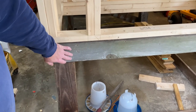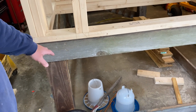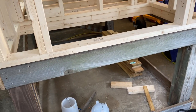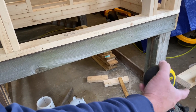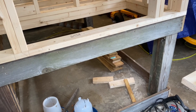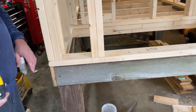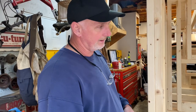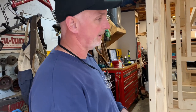We've got some five-quarter board kind of banding the top of it and banding around the bottom. We've got a couple of cross braces, and that's what we framed up for the chickens to actually have a lower run that will be covered by the roof. This whole thing will have a roof on it, and we'll have a door down here to where we can open it up and give them access to a bigger run as well. This lower run will definitely be predator-proof — everything will be hardware cloth, half inch by half inch, so it should be snake-proof for any larger snakes.